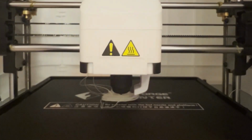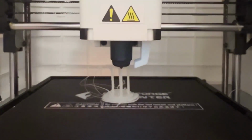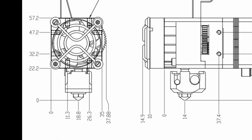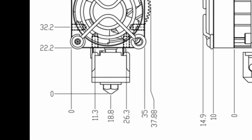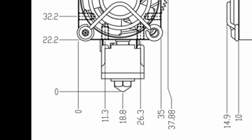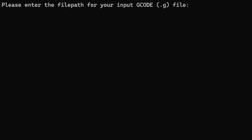This approach, which requires the printhead to move fluidly in all three axes, encounters problems when printing adjacent structures, since the printhead can damage the print while in motion. This requires careful ordering of the printed parts and a detailed knowledge of each printhead's geometry. A simple solution to this bottleneck would be the creation of a long nozzle for extrusion of this nature, so that the printhead could remain well above the print.